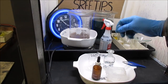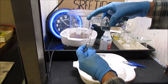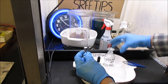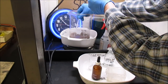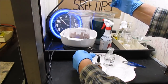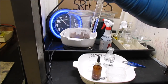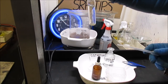I'm going to do a couple of tests now. Here I've got some water in a test tube. I'm going to add a few drops of hydrochloric acid to acidify the water, then add a drop from the solution. If we've got any silver in there it should turn to silver chloride as soon as it hits the tube. There it is — that's confirmation of silver chloride.